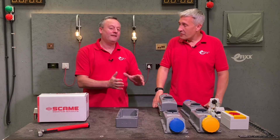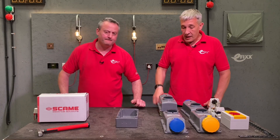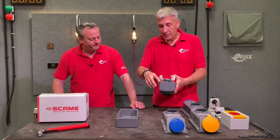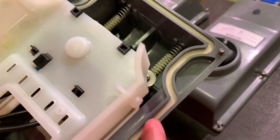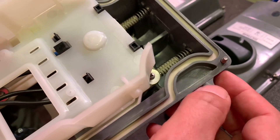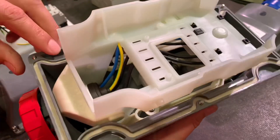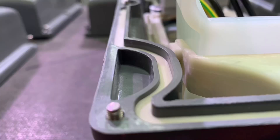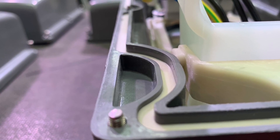That's quite a lot of tests in order to get those ratings on the front of this enclosure, and it matches those environments. They've been quite clever — there's a nice robust gasket around this product. You can see the seal around it, and you'll notice all of the fixing screws to fix it to the back box are outside that seal, with stainless steel screws as well. It's a single piece gasket — no breaks, a continuous seal. That's a fantastic piece of engineering.